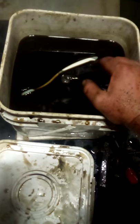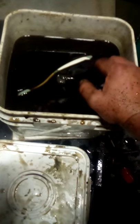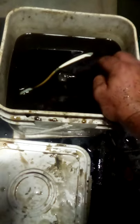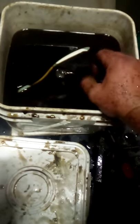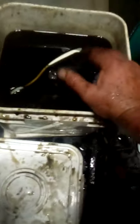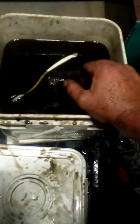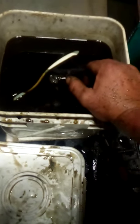You can multiply this culture pretty easily. Once you get a culture going, take half of it, top both halves up, put rusty items into each — you can fill two pails after you get a culture going. After everything in those pails is clean you can split them again. It's not something you need to be overly conservative about, and it's cheap to make.